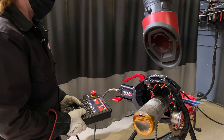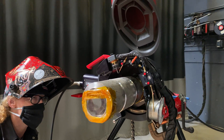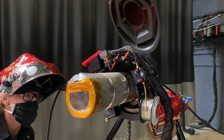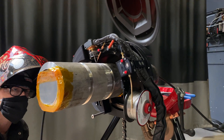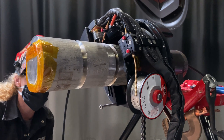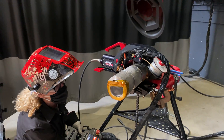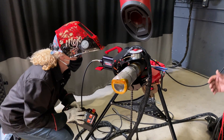When you look at the Helix M627, you'll notice that there is an onboard feeder. What's feeding into that right now is our 316L orbital TIG wire. This is precision layer wound wire designed specifically for these type of applications to ensure that you get a complete solution capable of delivering very high quality welds.